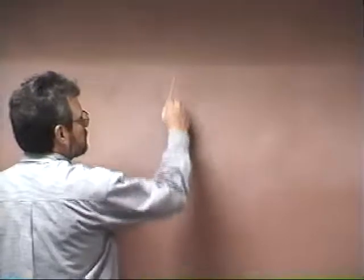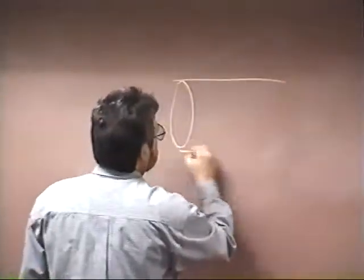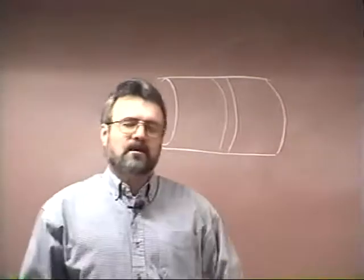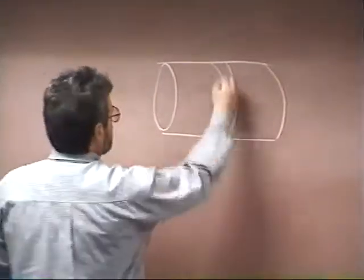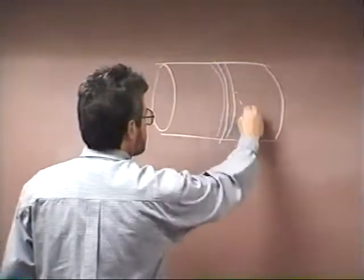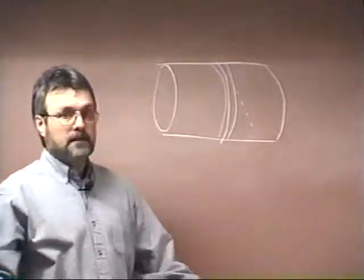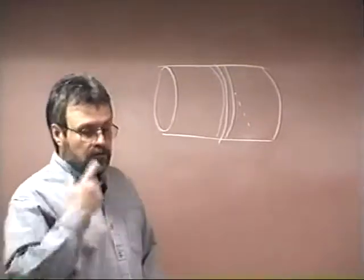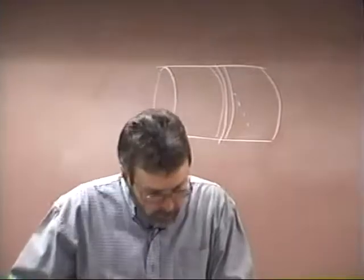One example of a laxity, and I've talked about this. Anybody taking this class has probably been with us for a while, so I've probably mentioned this before. If you've got a weld pipe right here and you've got a weld joint there, one bit of laxity is if you're welding this thing down and you get a little sloppy and you put an arc strike out across there, that's a cutout. So that's what they're talking about. No laxity in the quality.